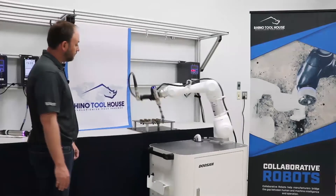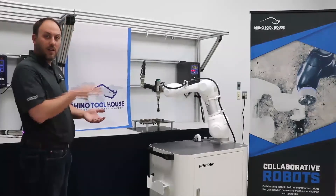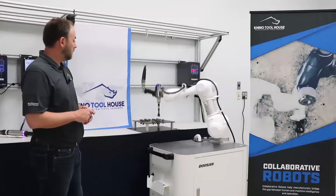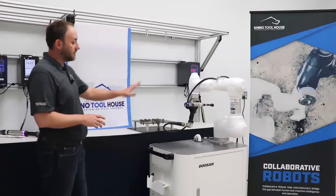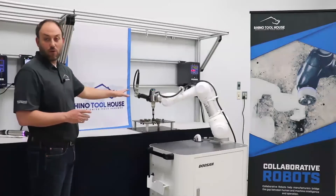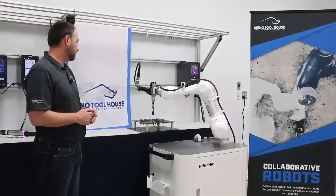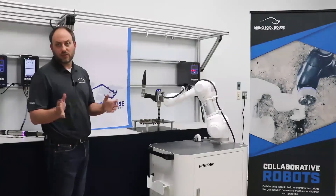The robot is moving down to the right location and giving the start signal to the tool. It receives the OK signal before moving on to the next location, knows it's finished the count, and then reverses those same bolts. This is the standard tool — not a fixture tool — and it's a tool I could take off the robot right now and run over on the joint kit by hand pulling the trigger. All the signaling is automatic. The Estet controllers can handle all field bus; we're using 24 volts because that's what the robot prefers.